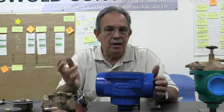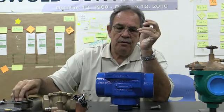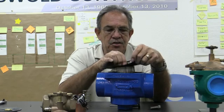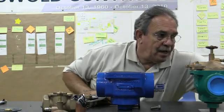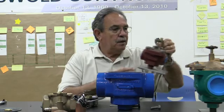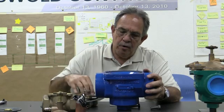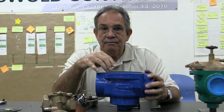this is very critical if you have reclaimed water or other than potable water. If you're in an area where you winterize the valve, so you don't have any water through the valve, what will happen is, if this is just a standard cast iron body, we actually paint the bodies, and it's just a paint, kind of a rust color. Without any water in the valve, you'll get growth of rust on this ridge where part of the diaphragm sits, and this happens because of iron normally.